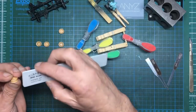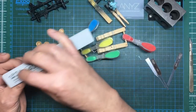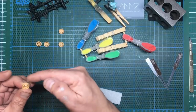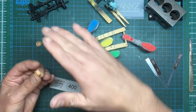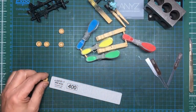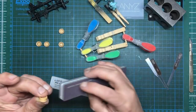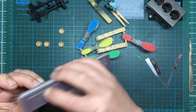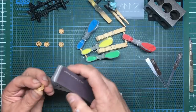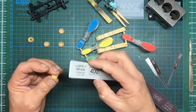If one sprue nib is a little higher, just come along and take that down first, rough it out, and then just like that — come in, turn around, come the other way until your sprue nibs are gone. That way you can guarantee you don't end up with flats or angles, so when you look at the rim it's all consistent. Then if you really want to, come in with an 800 grit sponge to soften the sharp edge of the rim and take off any fine bits left behind.